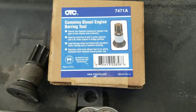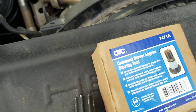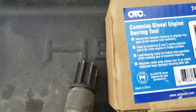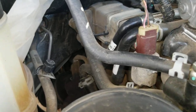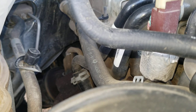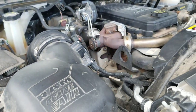One of the things that I ran into is I didn't really know where to put the barring tool to engage the flywheel. If you look online, there's a drawing that shows that you can get to that port on the back of the engine behind and above the turbo — but that's not going to work, at least on a 2013.